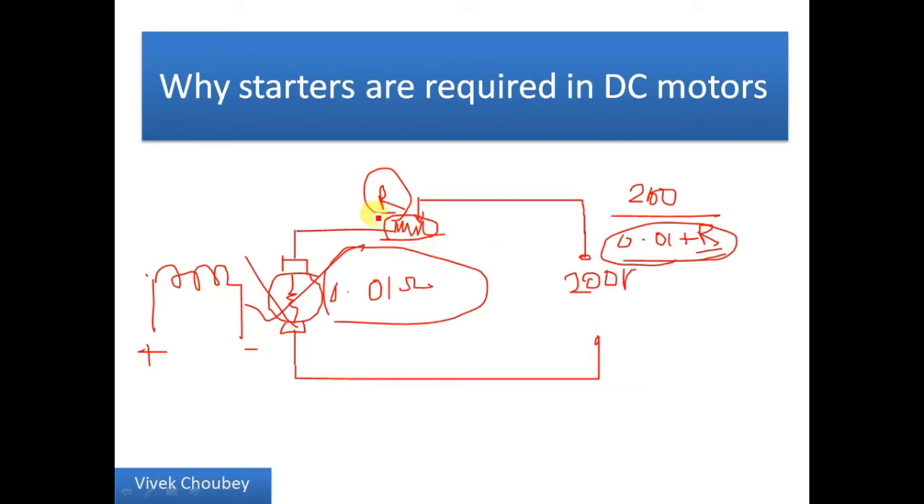So this is what a starter does and why it is called a starter. The starter has one basic use — whether it be an AC motor or a DC motor — it ensures a safe current flowing through the motor during start. The second thing a starter has to do is ensure safe operation when the motor is going to work after the starting period. These two basic things are why a starter is required.